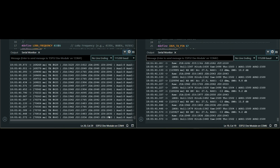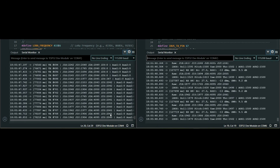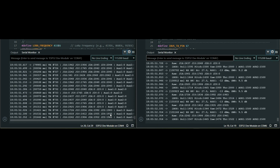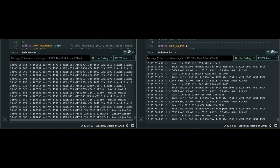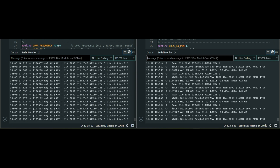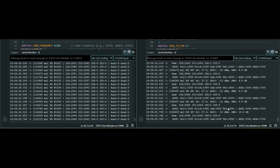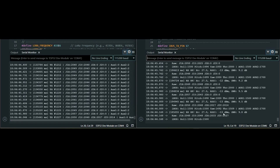You can see the values from the TX changing as you move the joystick — increase, decrease. On the receiver side the values also change accordingly. You can also see the RSSI value: if it shows around minus 120 dBm the range is very bad, but a reading of minus 12 dBm means the range is very good.